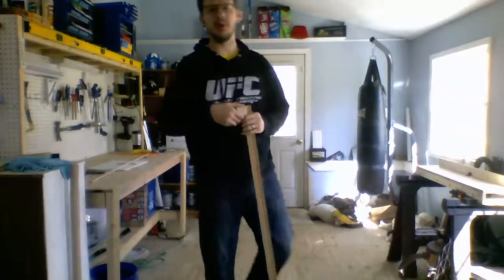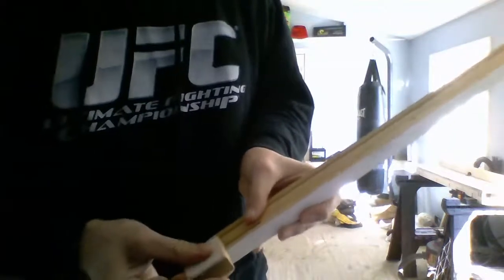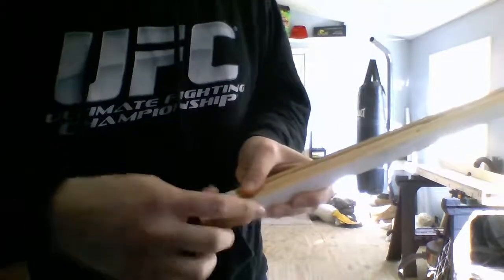So that what you end up with when you cut it, let's see how good I am with the camera, is that you end up with a nice groove through the center of it like that, which is a 1/4 inch deep, a 1/4 inch wide, and a 1/4 inch from the edge. And when you set the blade up that way, you're able to make a bunch of repeatable cuts that then fit together very snugly. It fits very flush. It's pretty strong, and then obviously once you glue it together, it becomes a pretty strong joint there.